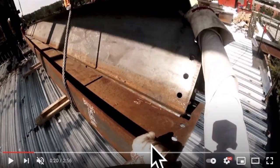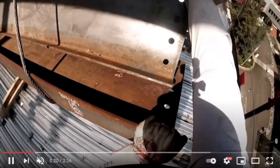I recommend keeping your palm on the flange, like on this side, and then having your fingers straight up. A good habit is to keep your hands open. Don't close your hands over flanges, kind of like how I have right here. That's kind of bad right here, but I still have all my fingers and toes. I haven't lost any of them yet, and I don't plan on any. But I'll press play, and we'll keep going.